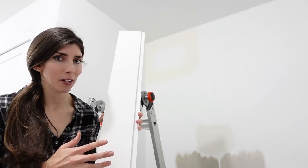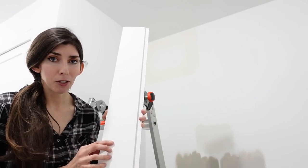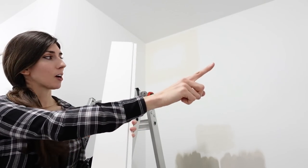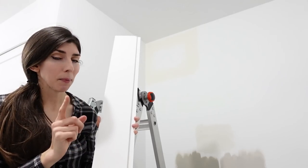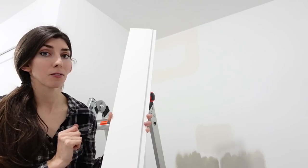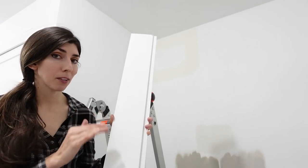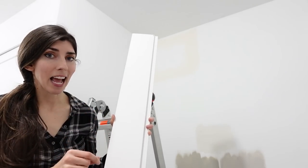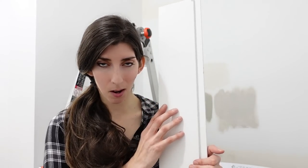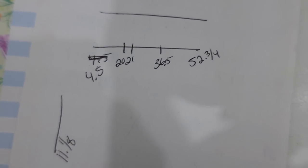I have my first boards cut at six feet long and that's going to take me all the way across the back span. The only part I have to notch out is right down where the water hookup is for the washing machine. I'll put the first few boards on and add those notches in later. Something else I did was take note of where all my studs are on the wall before putting this on, because it'll be harder to find once the boards are up — I just wrote those down on a piece of paper.